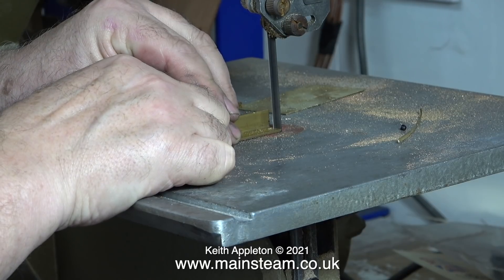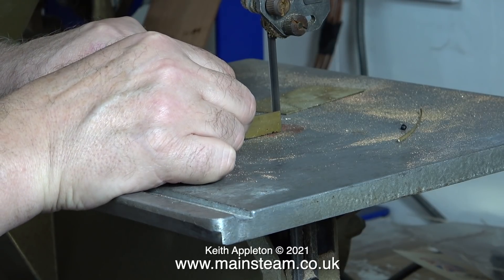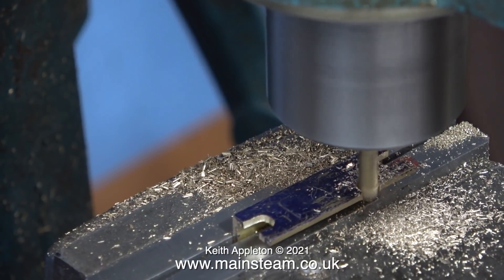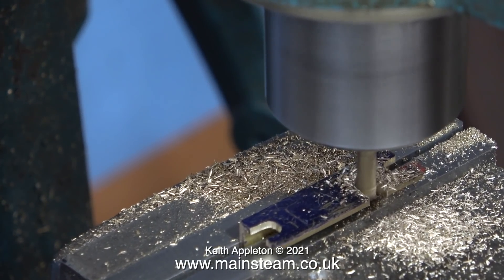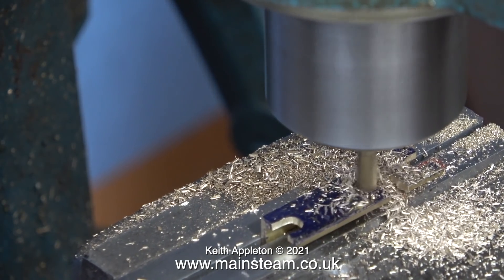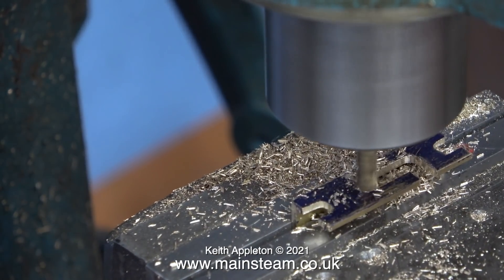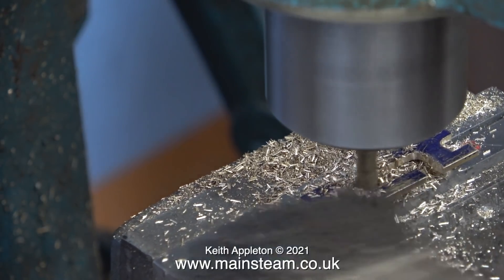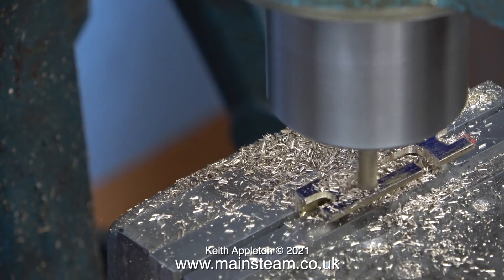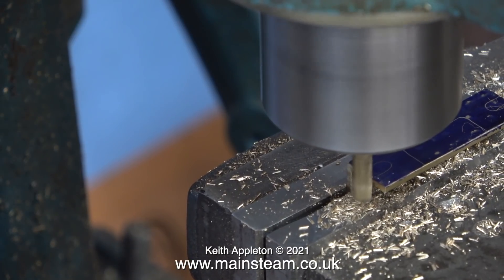There are two or three ways of doing this job. If you don't have a milling machine, this is a good alternative — I'm using a band saw. I've drilled two holes that I marked out previously and cut a couple of slots to meet up with the holes. In my workshop I have a very modest and very old milling machine, and this is the way I made the brackets — I milled a couple of slots, one at each end. I marked out the piece of brass first, but this is only an approximation; as long as it clears the slide valve everything is okay. All you really need is one block for the bottom that's thick enough to support the valve rod and stop it moving around.